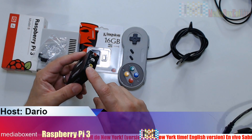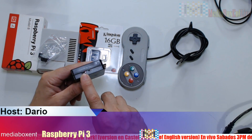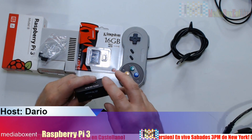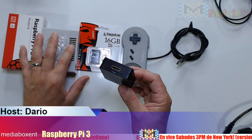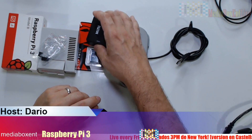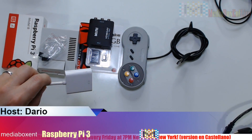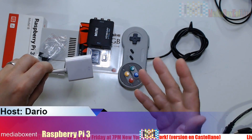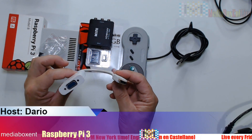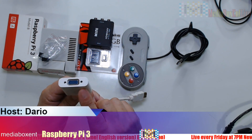The adapter provides left, right, and regular video — PAL and NTSC — with USB power. It comes with the cable but not an actual power supply; you can power it from a phone charger. This is a good option if you're planning to build this with an old TV, since it doesn't require much graphics — these are 80s games. And if you have a VGA monitor around the house, that's another option: one of these VGA adapters will power up your VGA monitor by plugging into the output of the Raspberry Pi.